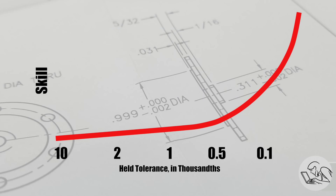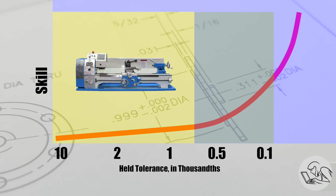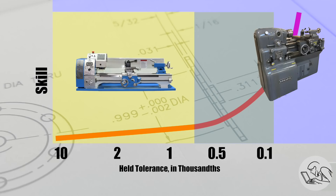Here's how I like to think about it. This is what I call the hill of precision, and we're all climbing this hill, especially when we're first learning. The bottom axis is the tolerance of a dimension that you can hold on a particular part. As we go down in tolerance, we get finer and finer tolerances. The skill required to hit those tolerances goes up pretty exponentially. Equipment matters also. Shown in yellow is hobbyist grade equipment, and in purple would be high-end professional industrial tool room equipment. The overlap gray-green area is where, if you have enough skill, you can make low-budget equipment do those things — but if you have high-end equipment, you don't need as much skill to hit those tolerances.